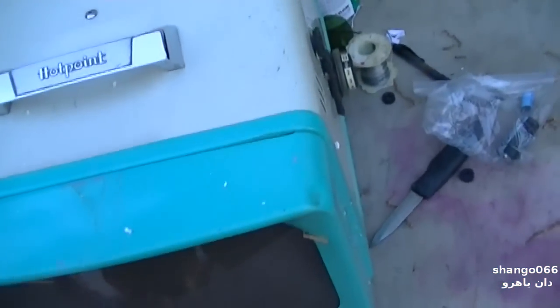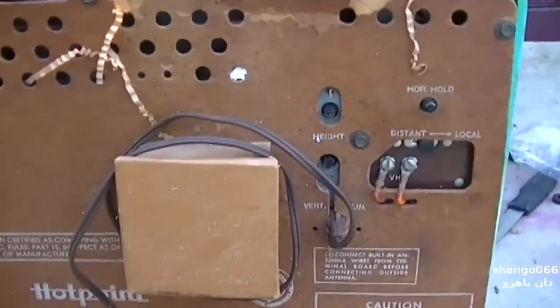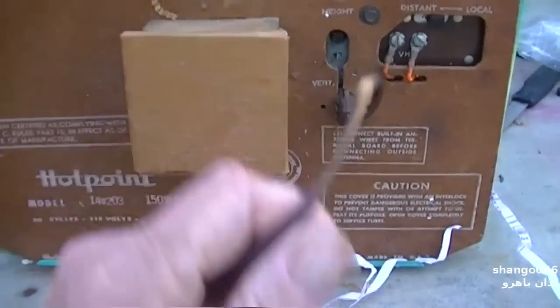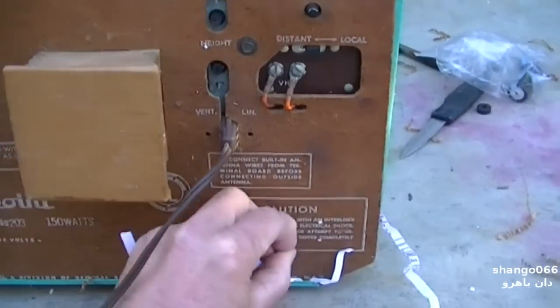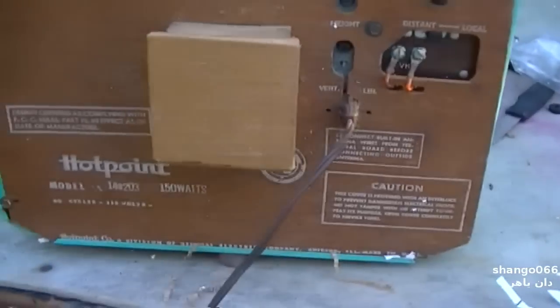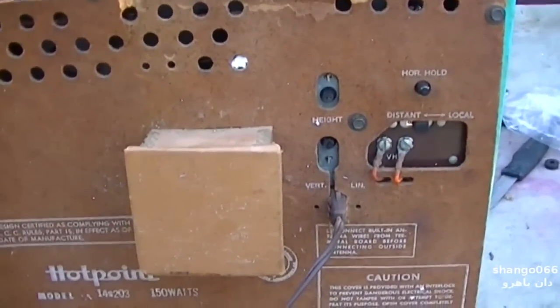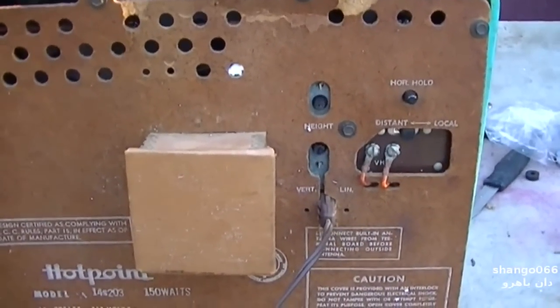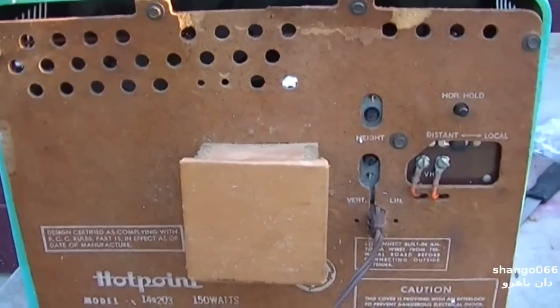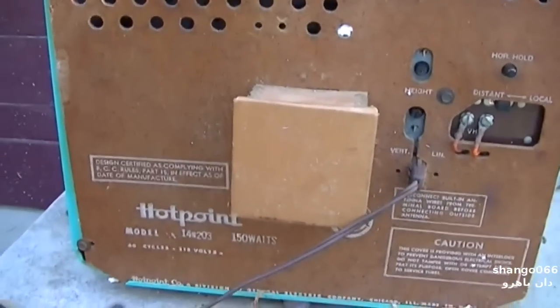This looks a lot like those little GEs. You know, I restored a couple of those — they come in different colors. In fact, it was a pretty long series of videos on it because it turned out that somebody had rebuilt the picture tube and they didn't coat the back of the picture tube with aquadag; they just spray-painted it black. So there was a weird noise in the picture because there was no filter capacitor on the high voltage, so there was ripple getting into the anode. Very entertaining video. Let's get this open and check the picture tube.